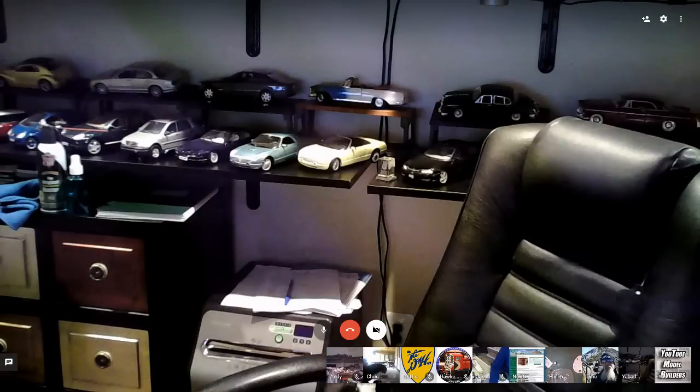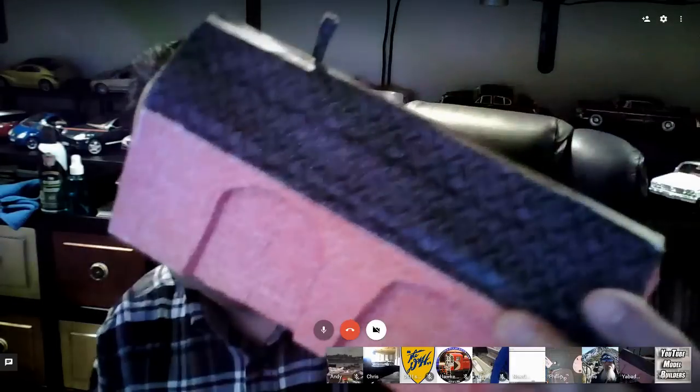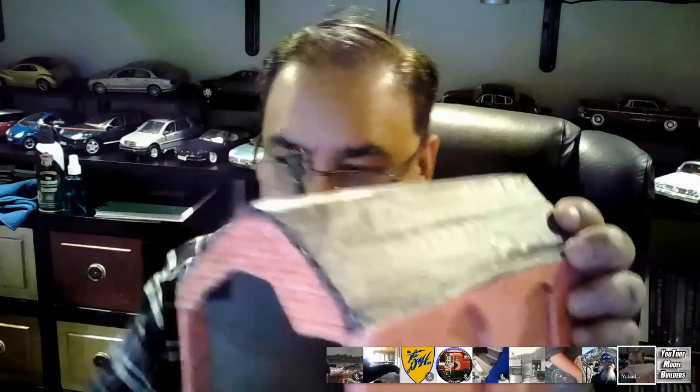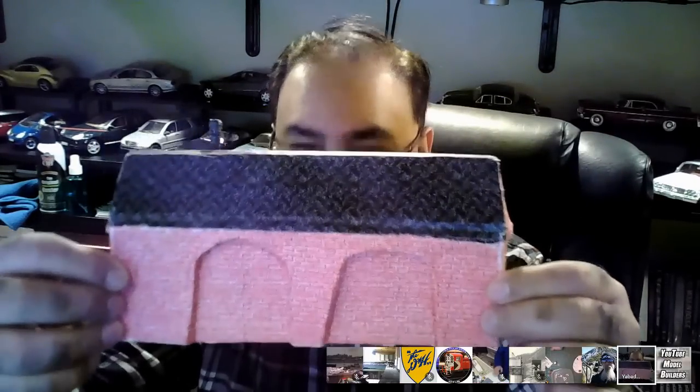Yeah, boosters provide amps. Ideally, you want to keep the voltage constant, whatever it is. If you had 14 volts in one district and 7 volts in another, and your locomotive was running at a quarter speed and sipping 3.5 volts off the line, if it goes across and hits that 7 volts, it'll just keep right on trucking. But if you're running 14 volts on one and 7 on the next, and you're running along at 3/4 speed, an Amtrak clipping along at 80 miles an hour, and you're pulling 11 volts off the track, when you hit that 7 volts, it's going to drop down in speed.